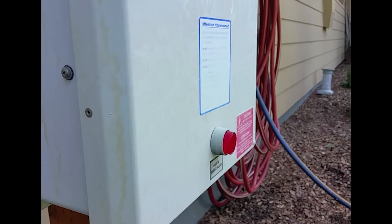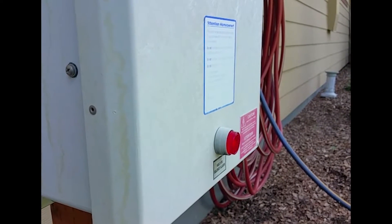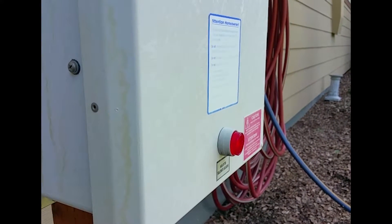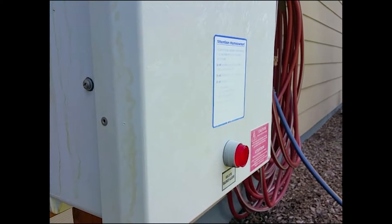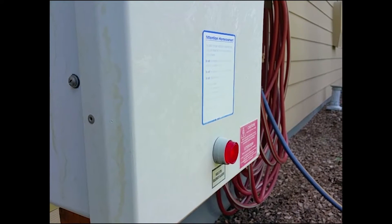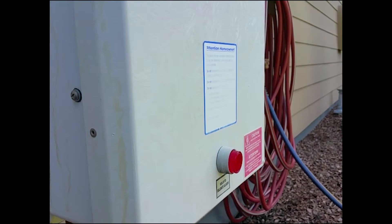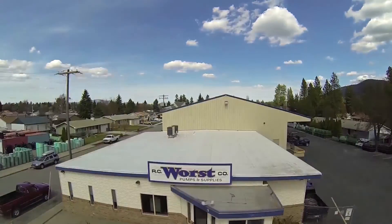With the system in test mode, it'll cycle every 30 seconds or so, so you'll get a lot of water dosing through the system. You can test the squirt height and different aspects of it, and you can test the motor amperage if you want. You also will not activate any alarms through the Vericon remote monitoring system if it's in test mode, so if you pull the float tree out or cause any other issues, it won't send a bunch of emails to the operator on that end. We'll see you next time. Bye.